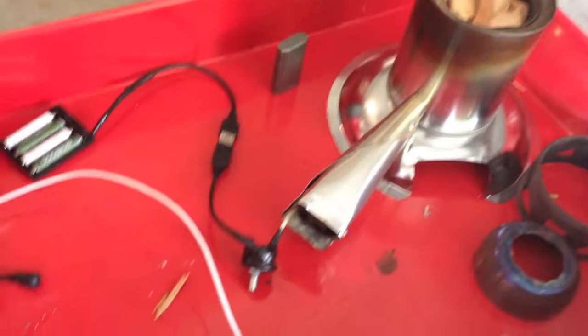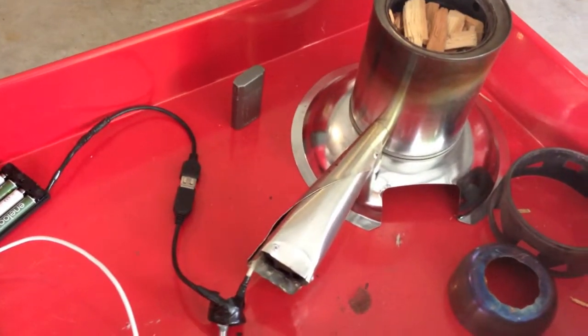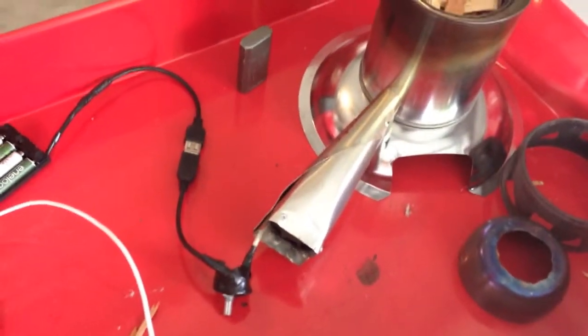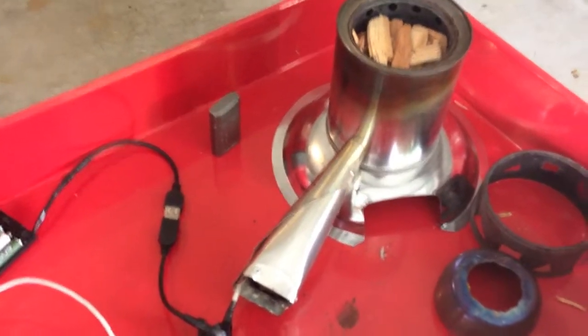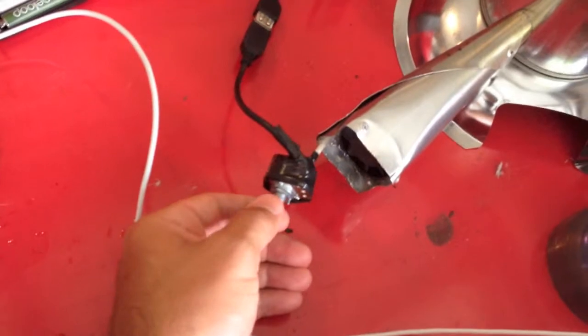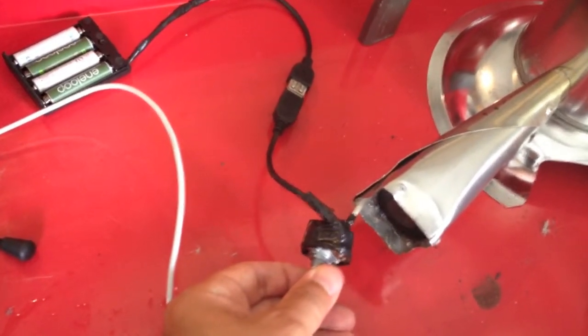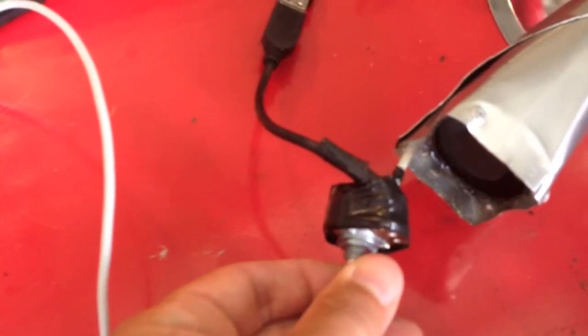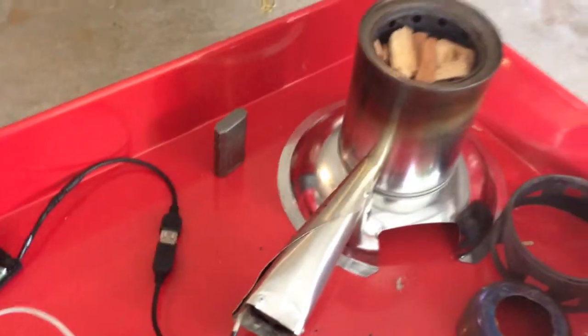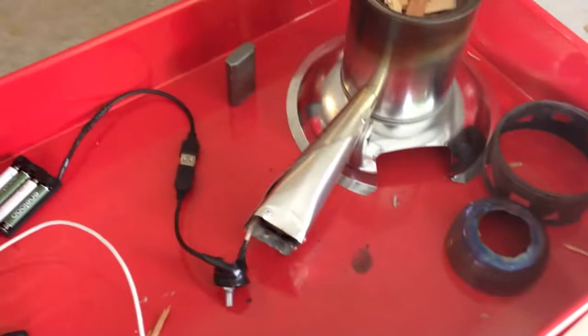I've got my little air funnel in there. When I was first testing this — especially with the mug stove — it felt like the fan was actually pushing too much air. I eventually Googled what to use and found a potentiometer, which varies the voltage coming from the batteries. This one is actually too big so it doesn't adjust much, but it can adjust the speed of the fan or turn it off completely, which seems to help if the air is overpowering the burn.